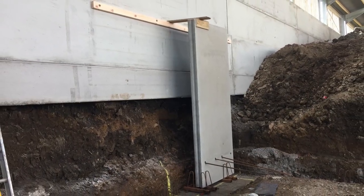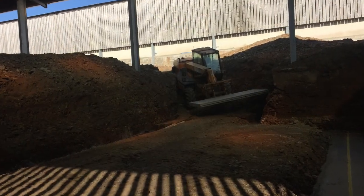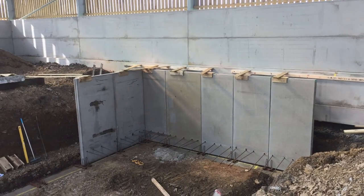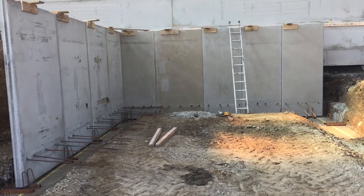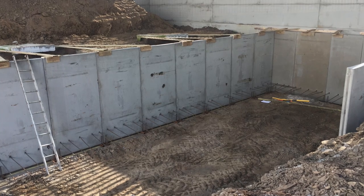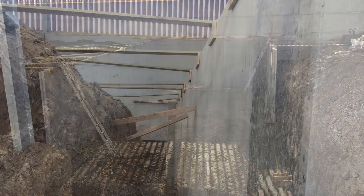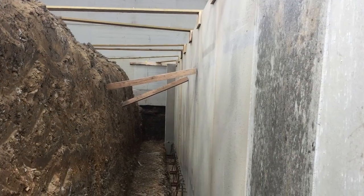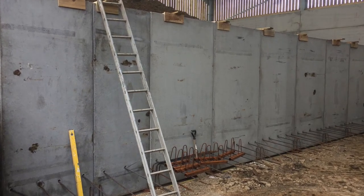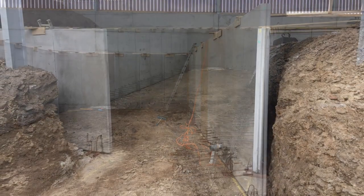After the excavation of the hole had been done, it was finally time to stand the panels up — what a job this was, very difficult. We had to drive all the panels down the ramp, standing them up individually. They did sit on cradles which helped to keep them up. After that we balanced all the panels and held them with wooden straps from across the top, as you can see from the photos. We had to do this all the way around before the concrete footing for the panel could be laid to hold the wall in place.